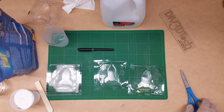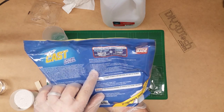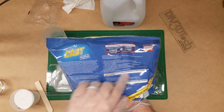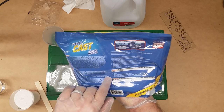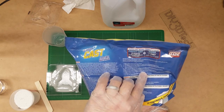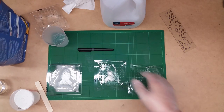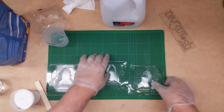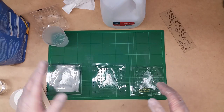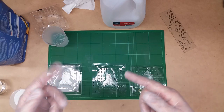The working time on this is pretty quick. We mix for approximately two minutes. It needs to sit for at least 45 minutes before being removed from the mold, and 24 hours before completely cured. I think I read somewhere around just 15 minutes of working time, but if you can de-mold in 45, you have a pretty short working time. So what I'm going to do is clear the area, and as I mix this stuff up and pour the molds, I'm going to switch to time-lapse. Then after 45 minutes or so, I'll come back and we'll take them out of the mold. Let's mix this stuff up.